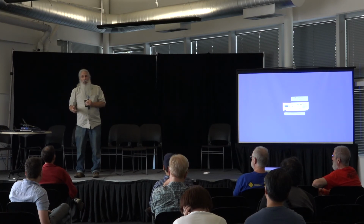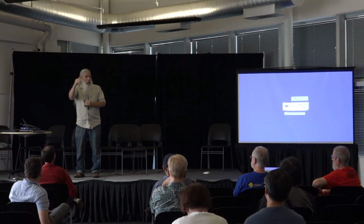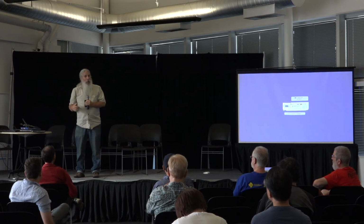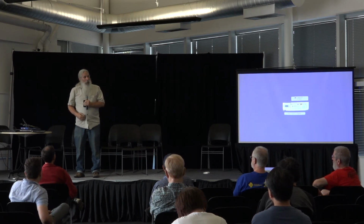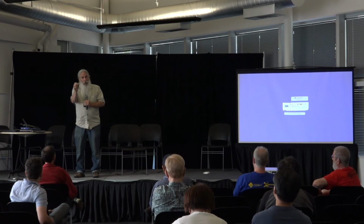In some cases, you need to do forward references where we just need a label. So I have a function that just does a forward label. They just have to be predefined as a label. You say, I'm doing a forward label. I just have an F label is what it is, and it says it's a forward label. Then it knows later on, when you actually define the label, that it needs to be patched. So it creates what's called a linked list where it keeps track of what all of the forwards were, and at each location where it's referenced, it keeps track of what kind of reference it was.